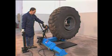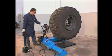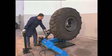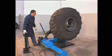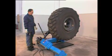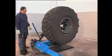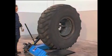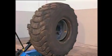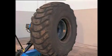After which, move the disc tool to the opposite position and set it against the inner bead. Push the bead and let it turn anti-clockwise. The tyre, so released from the bead wire and fastening ring, will slide easily outwards, so detaching both beads from rim.